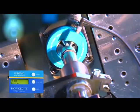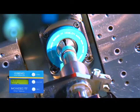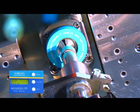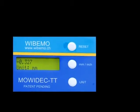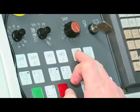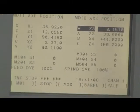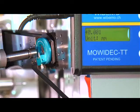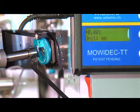Manually rotate the guide bush holder by 180 degrees to permit the probe to compare the distance between the top and the bottom of the tool with respect to the exact center of the machine guide bush. The value indicated at this precise moment is twice the real centering error of the tool on its vertical axis. This value must therefore be corrected by half using the machine digital control. Once corrected by half, check that this value is actually the same at the beginning and end of the 180 degrees.